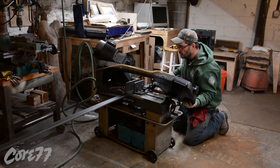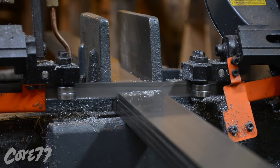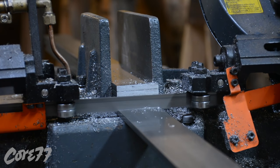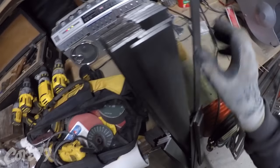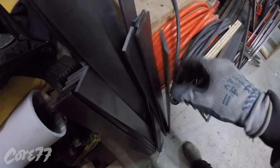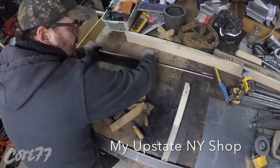I can stack up a whole bunch and just make a slow clean cut through all of them. You get some really nice accurate cuts if you take your time and have some good stoppers. In one of these pieces of video you can see I have a long rod with a stopper at the end — and there I cut all my pieces. It's great to get those big giant 12-foot bars into more manageable pieces.